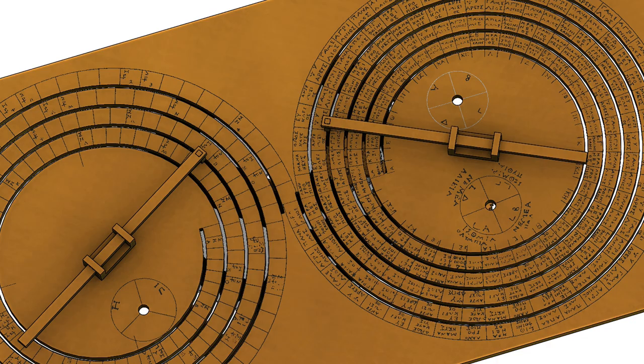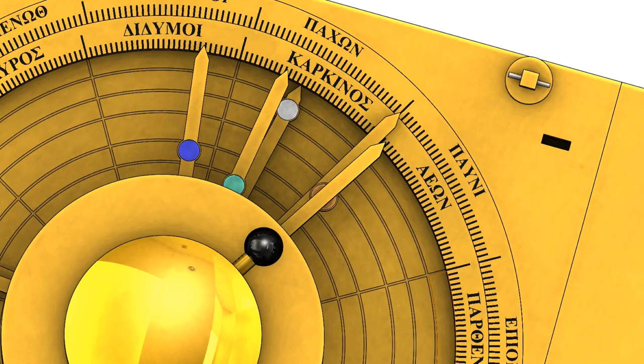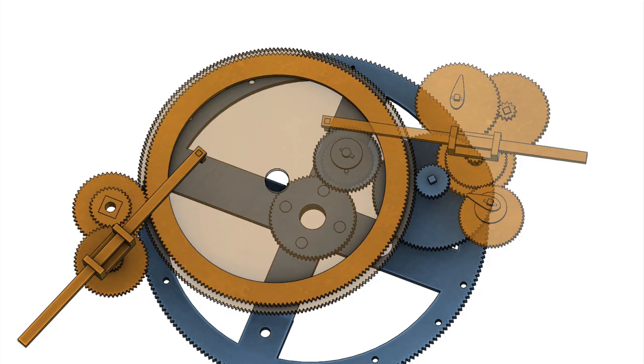Now, since a lunar eclipse can only happen at full moon, and a solar eclipse at new moon, the day of the eclipse could be easily identified by simply noting the day that the required lunar phase was to occur, or by cranking the mechanism forward and using the front dial to observe the day of alignment. So, ignoring sign convention and viewed from the perspective of the pointers, the Saros gearing calculation can be presented as follows.